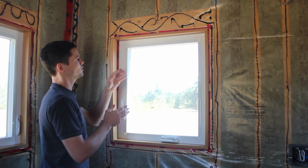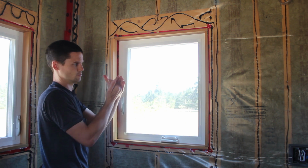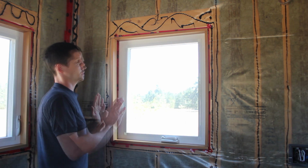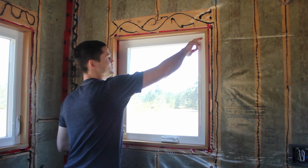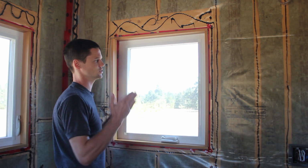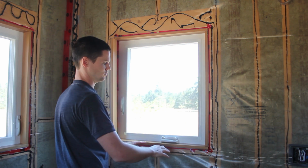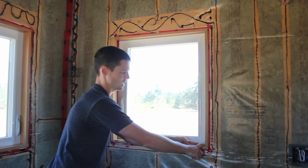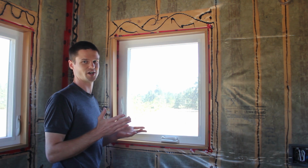Okay, so the sill gasket is a foam material, meaning it can compress, but it's also got some pressure trying to foam back out to its shape, which allows me to wedge things a bit better. Because I'm not an expert woodworking finisher, and these seams are important to make nice and tight, if I were to rely entirely on the precision of my cutting, with the pieces going hard against the rough framing and hard against each other to make a tight seam, we did it with some bad results because I'm just not good enough to make that happen.